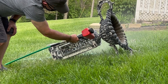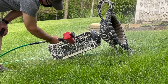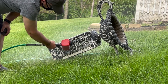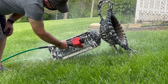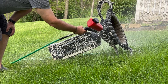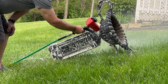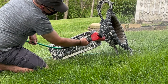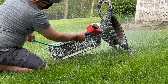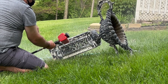But as you can see there, it's really loosening the white paint up. Was it perfect? No — it left a lot on there in certain places. In the end, what I ended up doing was getting our pressure washer out and going after it with that. That was really the saving grace because what the soda gun had loosened up, the pressure washer was able to finish taking off — it had just enough extra pressure to really do the job well.